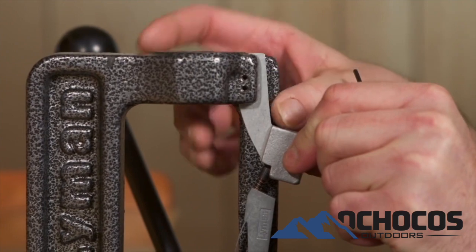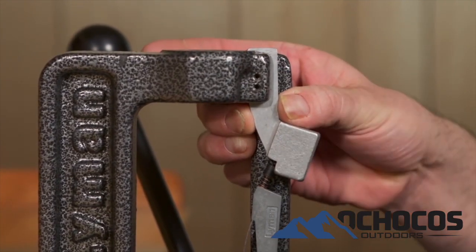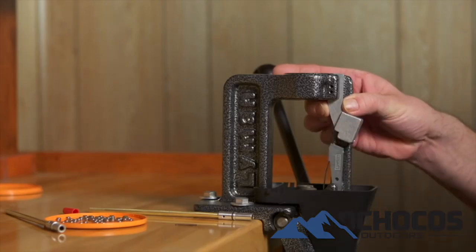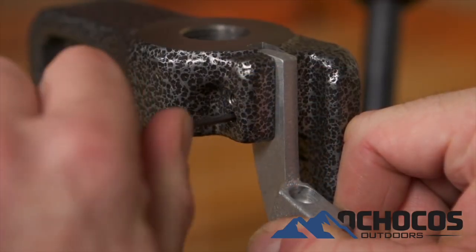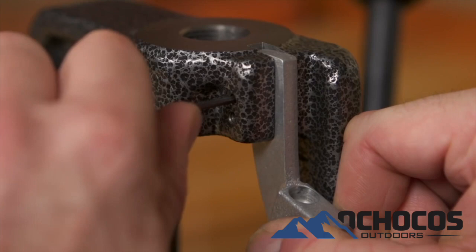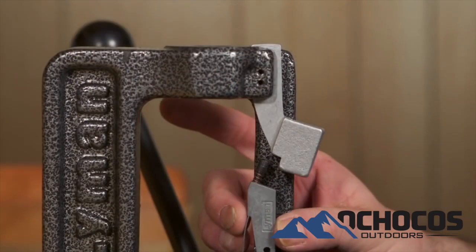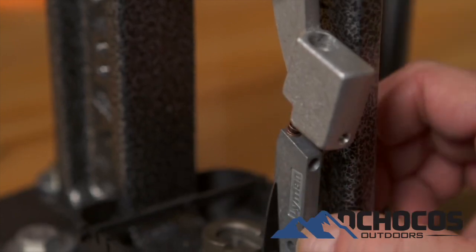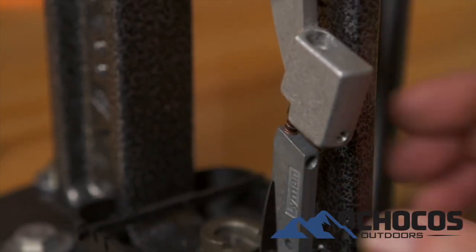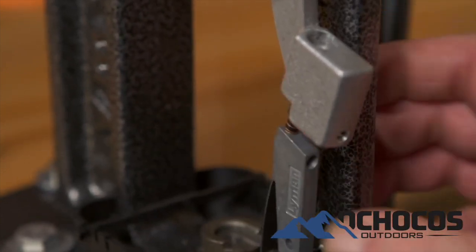Place the primer feed body between the lugs of the press body on the crusher press or the lugs of the turret on the T-Mag press and tighten the lock screws. The angle of the primer feed must be adjusted up or down until the primer tube is directly over the priming punch sleeve when the priming arm is in the back position.